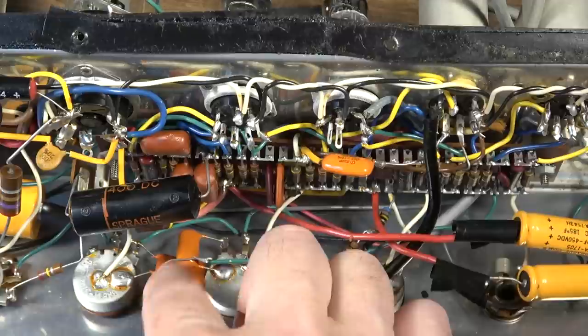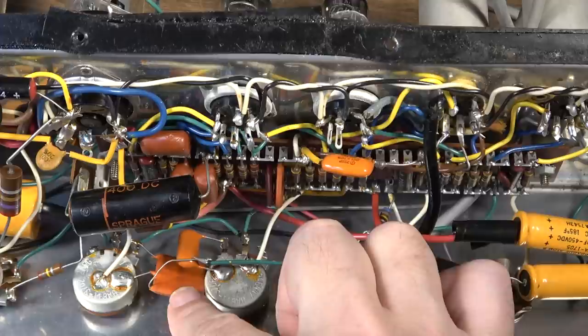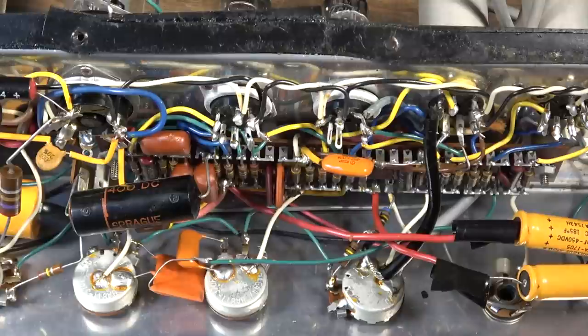That's a Sprague. These things are basically a tone shaping network. It's kind of an all-in-one little thing, and they were really made to take out certain frequencies and accentuate other frequencies in these amps. And the reason for that is they were trying to keep the amp as clean as possible all the way up the dial with Gibson guitars. That much seems pretty apparent to me.